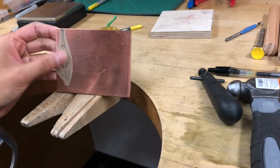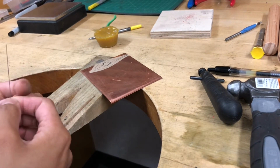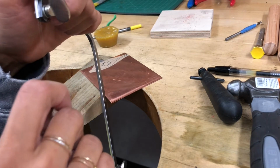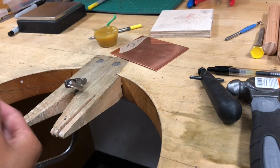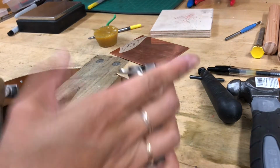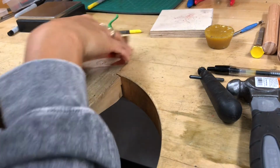For detailed, really kind of thin cuts like these, we really want to use the thinner saw blade. So the 3/0, the 3-0 is going to be the one that you want to go for. If you're all out of those, then the 2/0, the number 1 blade is going to be really, really thick. That's all you got. But so that nice musical note. Oops, duh, I always do that.